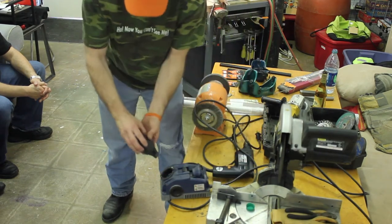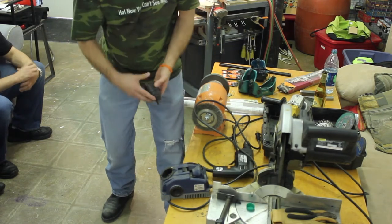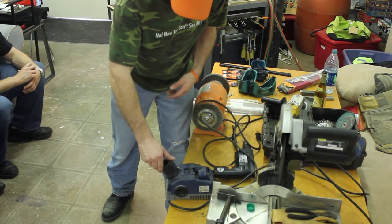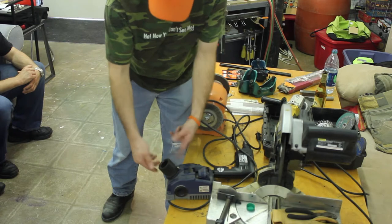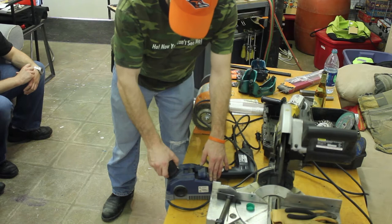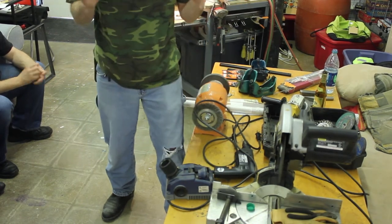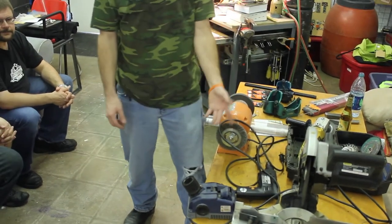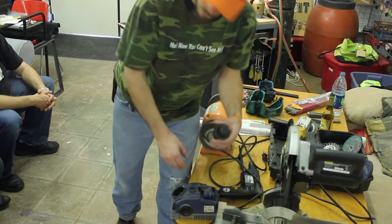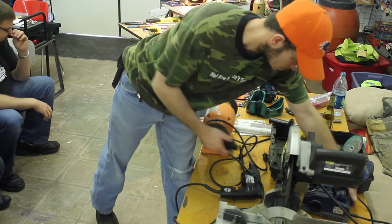Then you take it out, stick it in over here, and there's a diamond-coated kind of like a Dremel barrel disc in there that rolls around, and you stick this in there and rotate it. It has a beveling on the outside. If it was tight, you would see it. Right now, it's just kind of spinning. It has a beveling that, as you rotate it, bevels the tip to just the right proportions. The most ridiculous contraption. If you tried to get me to invest in this, I'd have been like, dude, that's never going to work. But it works. It's totally restored a lot of bits. Love it.